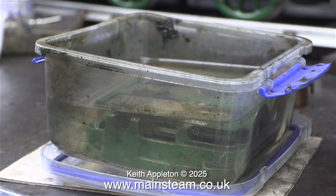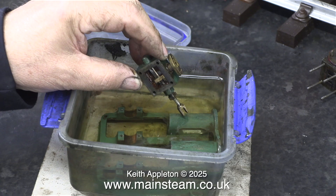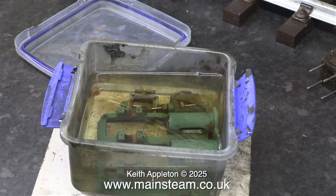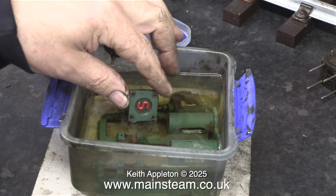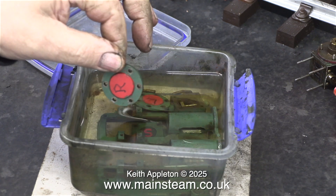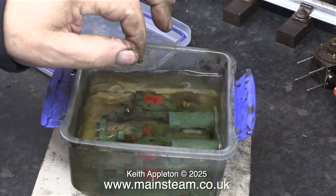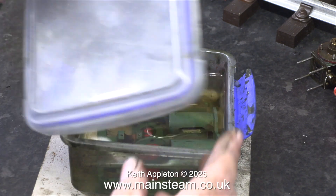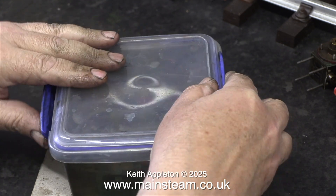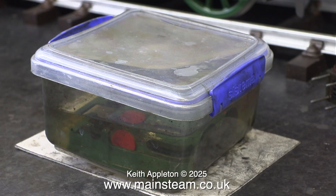This was a very good quality food container — now it's a very good quality container for cellulose thinners, but unfortunately it is warping and bulging slightly. With the exception of the box bed that just doesn't fit, I'm putting all the painted parts into the cellulose thinners, and hopefully after some time has elapsed the paint should fall off. If it doesn't, then it's going to stay where it is because it's baked on — this often happens with steam engines. With the exception of the end cylinder covers, I will rub down the paint with some sandpaper to key it for another coat of paint.